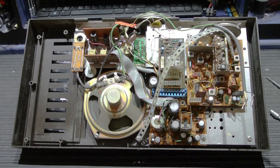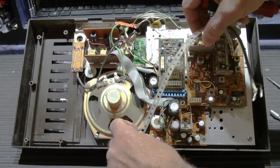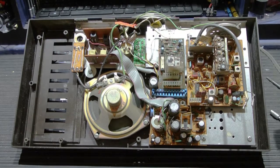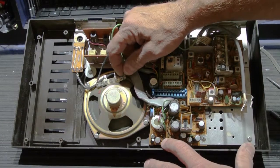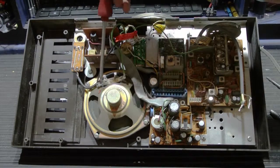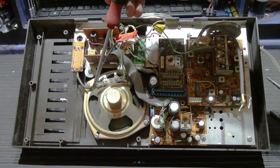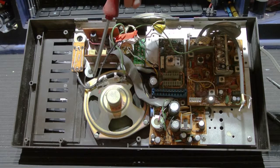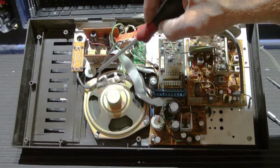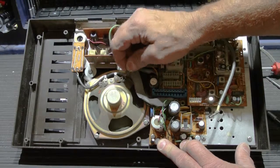The very first step to do, what I like to do first, is let's take the screw out of the faceplate and get rid of the support strap because it seems like it's always in the way. The next step would be to unplug the wires from the speaker terminals. You'll notice that there's a red dot under the dust on right here on the speaker frame. On NuTone systems, the red dot is always the black wire. Or you could put a piece of tape on here and write red dot or something to identify it. Since I already know that, I'm not going to worry about it. I'm just going to unplug these.